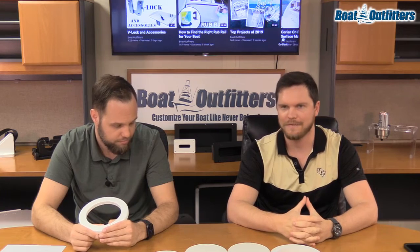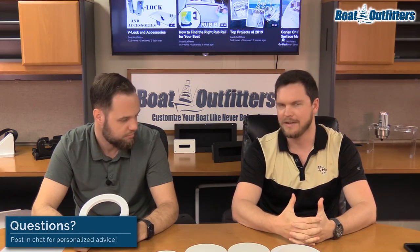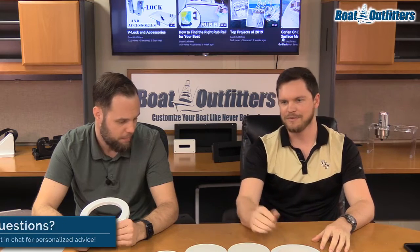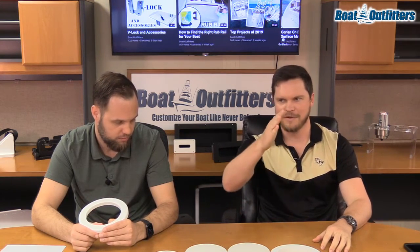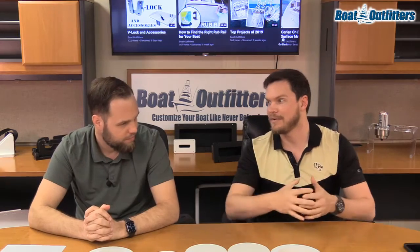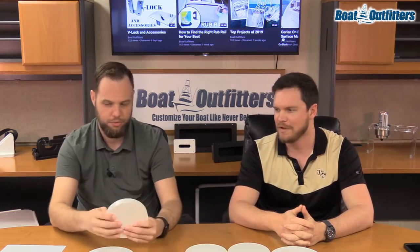You run into a lot of curved surfaces on boats, a lot of transoms. The ones that I think I've done the most for are transducers. If you're trying to mount the transducer to a curved transom, your transducer might be coming off the back of the boat at an angle, and you want to get it more in line with the direction the boat's going to be traveling, so you're not dragging the transducer sideways through the water. Believe it or not, I've done more of those than any.